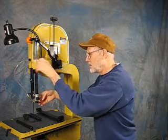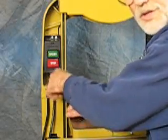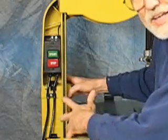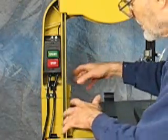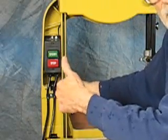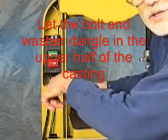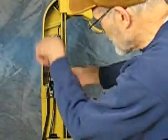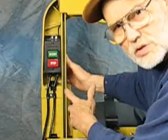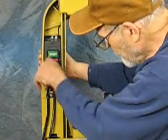When you're putting the long bolt in over here, it doesn't really want to go in place. What you have to do, while it's all off in pieces, is put the lower block guide — or the riser block — with the up arrow in the back pointing up, put it in place first. Put the bolt through, and then you've got to do a little dance with the air hose in there. You want to put the air hose into the back side of it, stick that in, and then guide it down as you lower the block down.